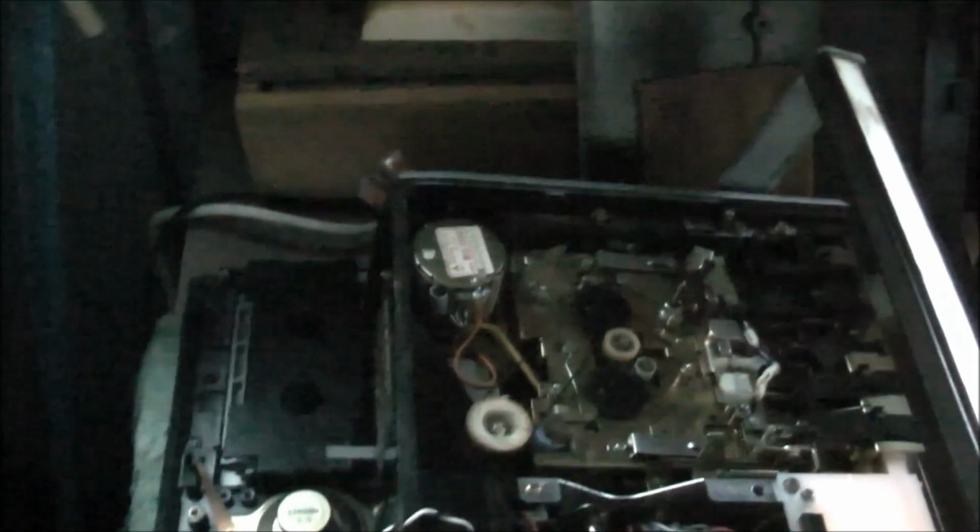So I thought, well, maybe I'll get a transistor from somewhere else. I got a transistor out of a CFL light, because all it does is regulate the voltage to that motor, to increase the motor's speed, with a potentiometer inside the back of the motor. A transistor like that would more than likely be a good candidate for a replacement. To test it, I touched the leads to those three leads and the motor worked. So now I've got that transistor soldered in.